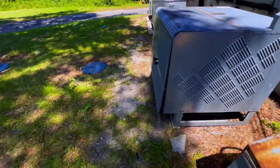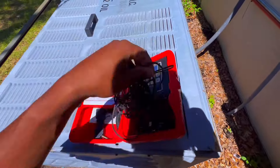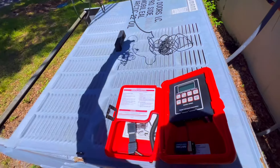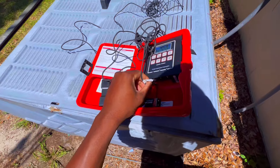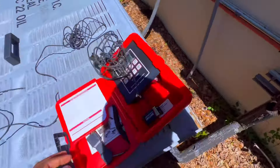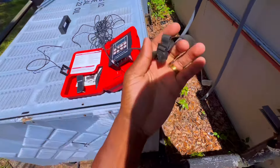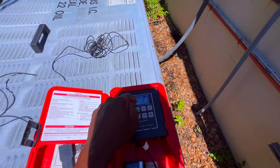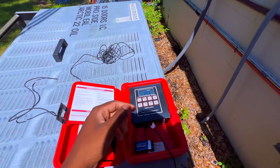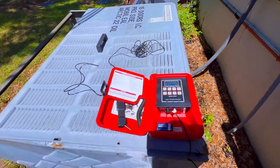I need to compare it to a unit that's on. That other one's pretty normal, not that hot. First thing, let's get the liquid line temperature. I'll hook up this temp probe — y'all should get one of these, very very useful. We are getting 114 degrees. This is a 404A system. I gotta look at my PT chart but that temperature is really high.